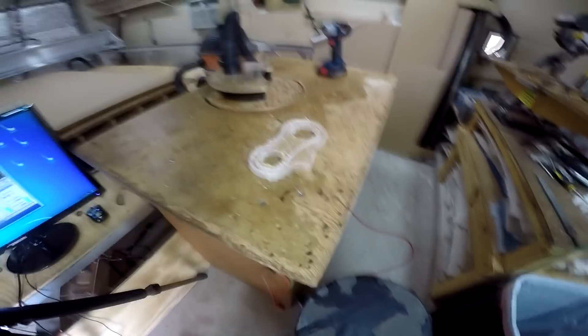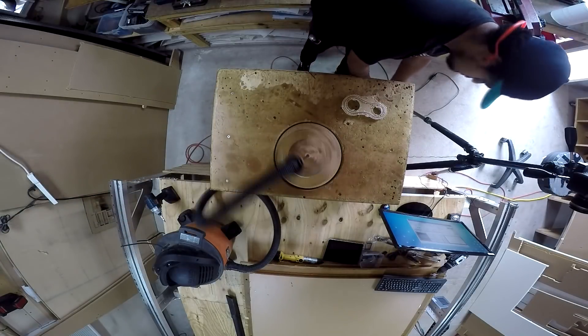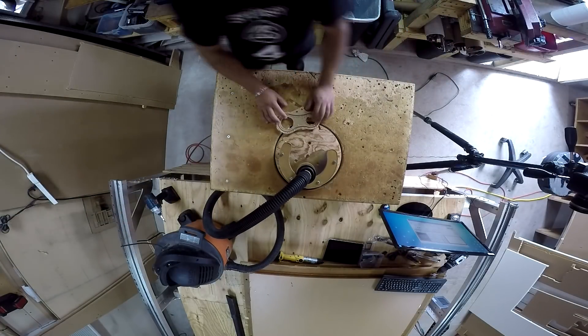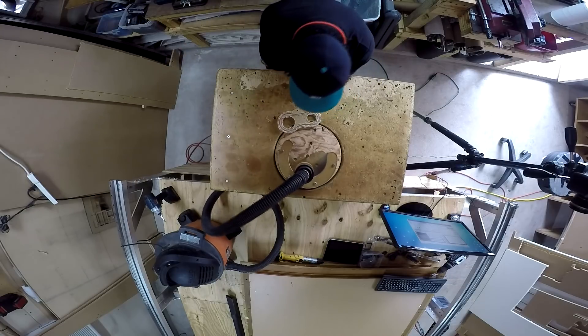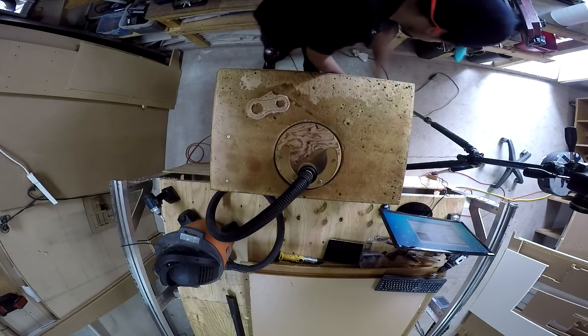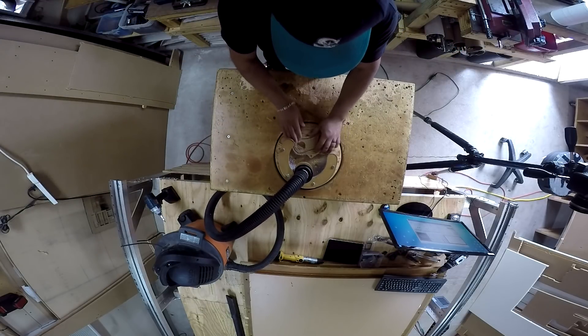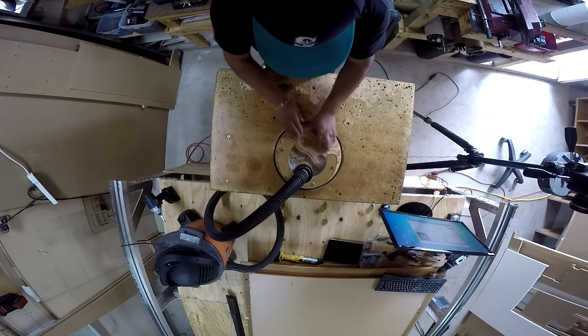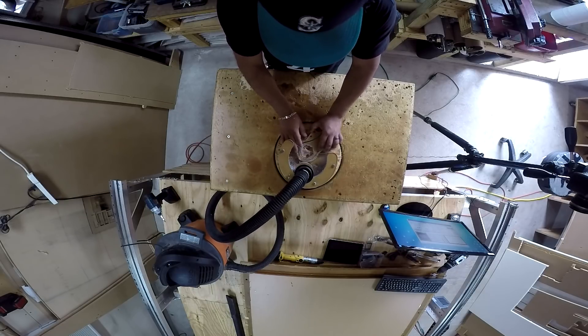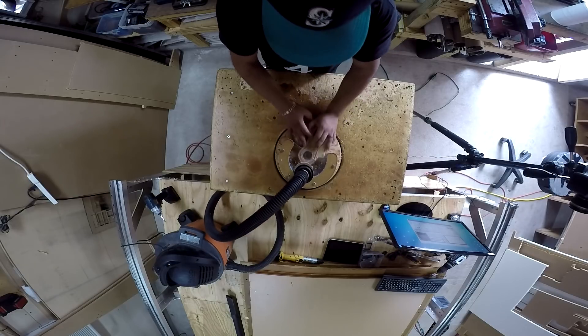This table was made with a Lazy Susan and then improved by adding a plexiglass shield on top with a vacuum, so about 90% of chips and dust get sucked into the vacuum. The plexiglass also doesn't allow you to get your fingers close to the routing bed. We have a brush around the crescent portion where the wood is, so you can pass material through that.